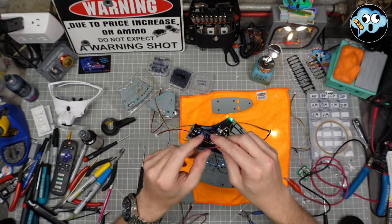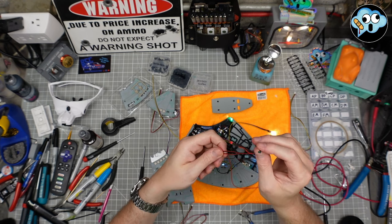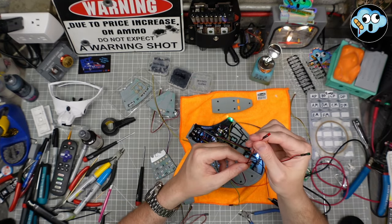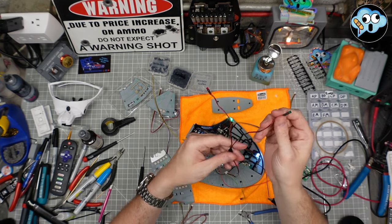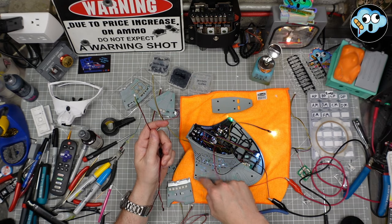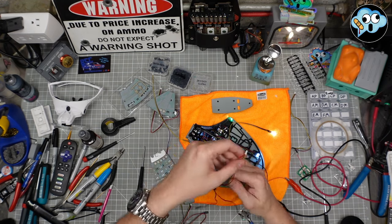And then when I cut out this circuit, I then also replaced these, which were white LEDs that I colored with marker. I replaced them with actual colored LEDs, red and green, 2x3x4mm LEDs. And I had to resistor both of them. So I added the resistor to each one, the appropriate size resistor. And that's how we were able to rebuild this harness with a green and a red light and an orange photon burrito launcher. And that's how we did that.